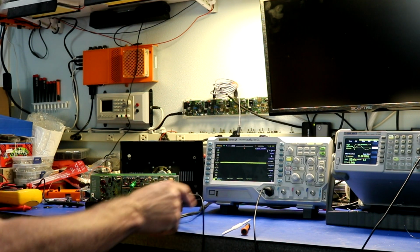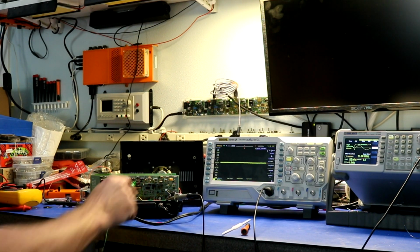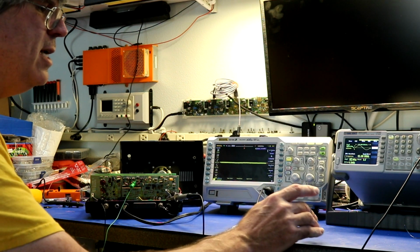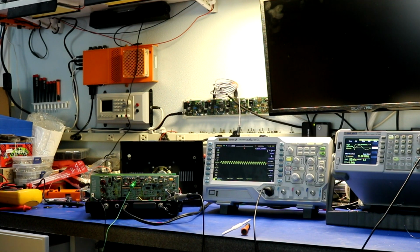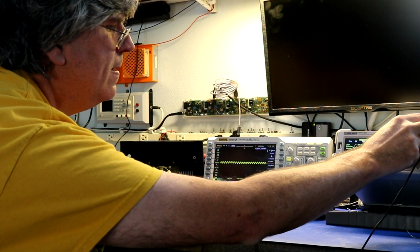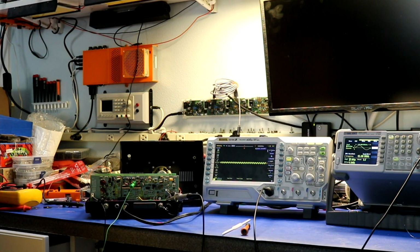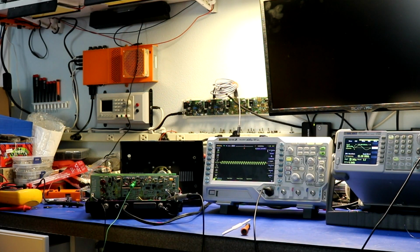And then I also have my oscilloscope hooked up to the audio potentiometer, so that's going to get the audio out from the detector, as well as ground. So we can see right now we're just getting noise on the scope. Now let's turn on the output. Now we've got a 1 kilohertz tone. We can try to bring this down. It's good to bring it down kind of low because you don't want the AGC to kick in. I think 100 was about right for tuning this up.